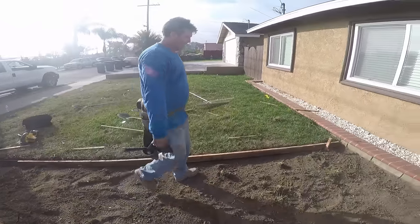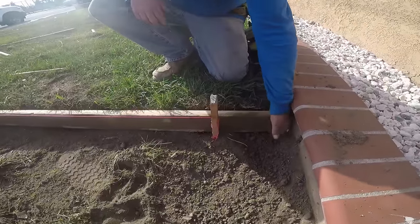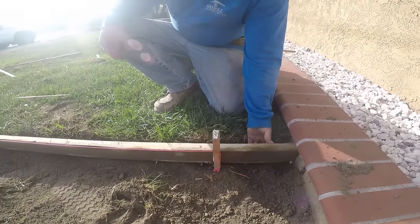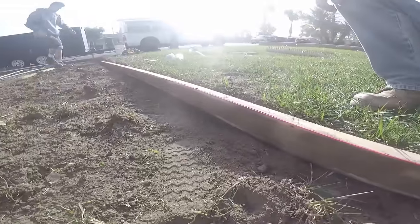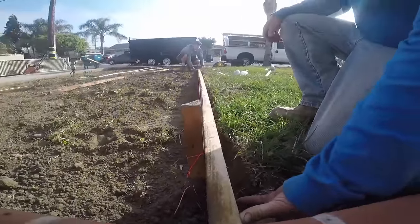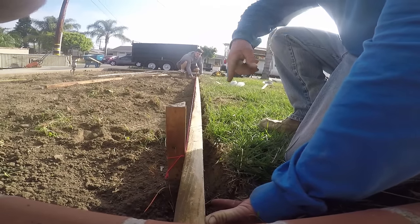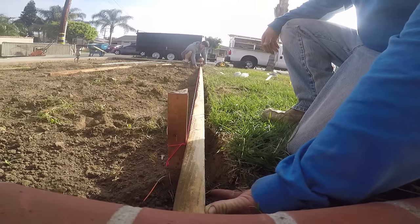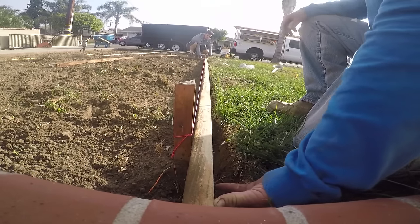There we go — take a look at this end here. We've got some concrete for the footing of this wall, which is always a problem. I just cleared it so we're good. We're right up against the line. Tyler, push that 2x4 to the inside out to the line so we can show this bow. Now you can see the bow I was talking about — I took a quick sight down the board. It's about a half inch there in the middle. I can stake either end, push the middle out, and the natural crown with it up means the weight of the board itself is almost setting it down to the line. I just nail it high in the middle, drive that stake down, and take the crown right out.